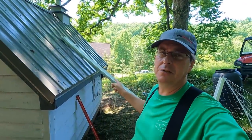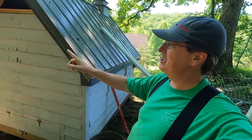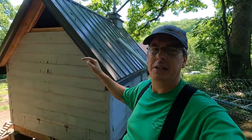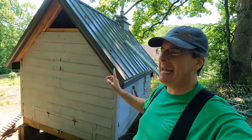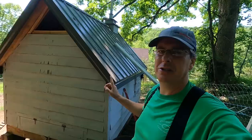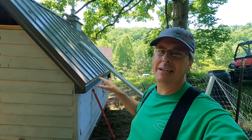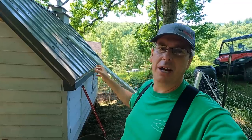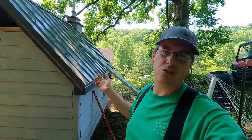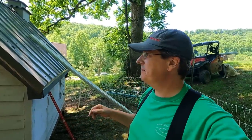Okay, so the first thing we need to do, of course, is get, come on, chicken, give me a break, the gutter section hung. Since we're going to do both sides of the chicken church, I'd have to have two downspouts like you'd do on a normal house, but we don't do anything normal around here. So I'm going to put a board across the back here, like a bridge, if you will, just an extended piece of wood to be like a fascia. And we're going to run gutter along this side. That's not to catch any rain per se, it's just to have the water on the downhill side be channeled over here so we have one downspout. So it's kind of a trade of material. It's going to look a little hinky, but it's on the back side of the chicken church, so it won't be that big a deal. Nobody but the deer on this side will see what's going on.